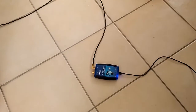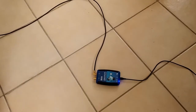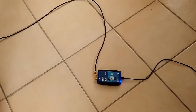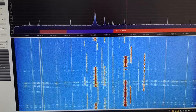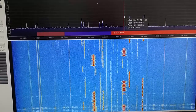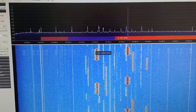I'm using just an ADALM-Pluto receiver and the antenna is a simple V-dipole, horizontally oriented. I do have a bandpass filter for 144 MHz, no preamplifiers, and the coax run is approximately 20 meters. This is during a contest on 144 MHz.